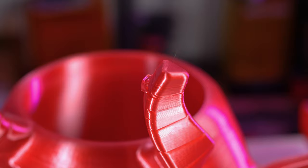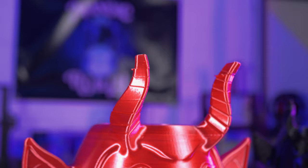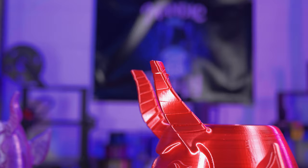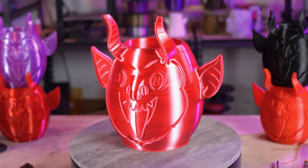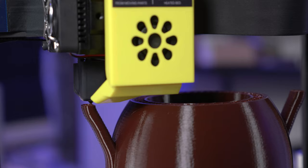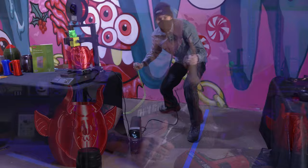In preparation for this, before I ever started the print, I tightened the belts on the Odin 5, leveled the bed fresh, tightened it down as good as I could to load the springs for a solid base, and tightened up all the frame screws I could reach. So everything was good and tight — the only thing that could shift and move was the moving components of the machine, which is where the little bit of inconsistency came in. Honestly, for what we did and if you're familiar with Philadelphia roads, I think this did pretty darn well. There is a glaring problem at the top of the horns, but that is my fault — not from driving down the road. When I picked the machine up off the table while packing up, the hot end collided with my hand and skipped steps, causing a major layer shift. I corrected it by grabbing the hot end and holding it in position and forcing it to skip back the other direction. Overall, this was a fun experiment. I pre-tested the UPS — I unplugged the Odin 5, let it run with a stopwatch, got down to one bar of battery life, and called it done at about 36 minutes of runtime. On the day of the market, we still had four bars of battery life left when we arrived at the show and plugged it in.